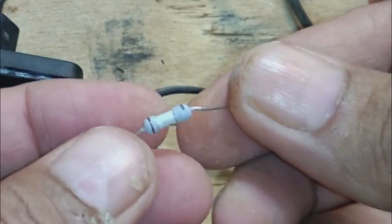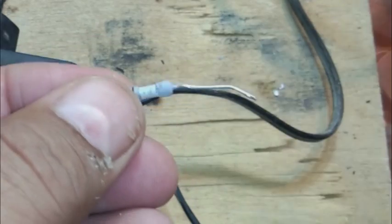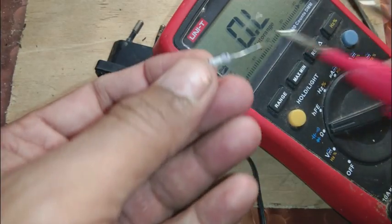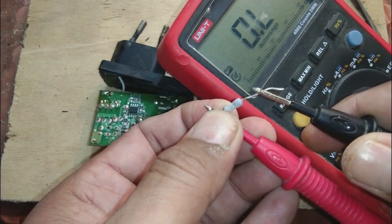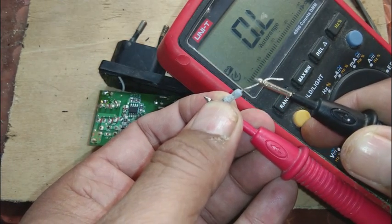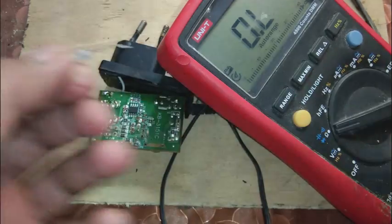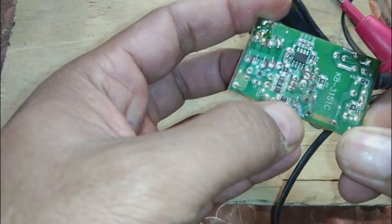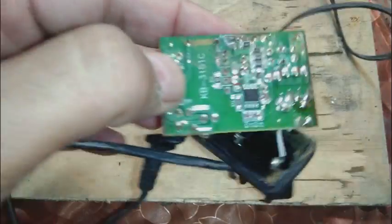You can see the wire has come off and the material in the middle is broken, which means this power supply has had some abuse. Checking it out of circuit, it shows infinite — out of limits. It should show very low resistance, so it is confirmed blown.